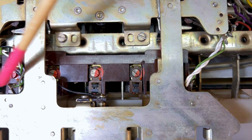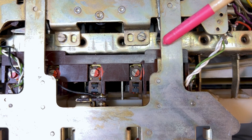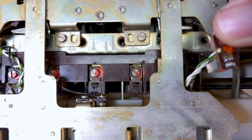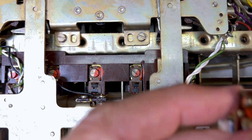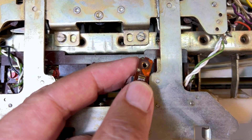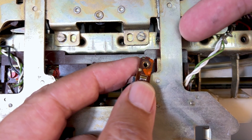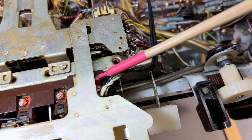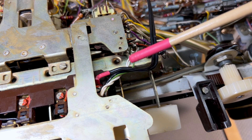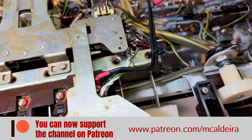I'm going to put this in place. You can see where these guys are — that will be FM, shortwave, medium, longwave. And this one here has got nothing on there, so that's where I'm going to put this little guy. But before I do that, I need to solder this on here, and then it will be tied in with a screw as I screw this down. All right, it's done. It's in place. The positive goes to the screw there — it's bent here so it doesn't interfere with that plate. The wires come out here, so we've got plus 6 volts and the ground that is switched with that phono selector. There's a little zip tie on here through a convenient hole on the chassis. This is going to the back.